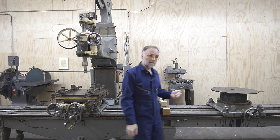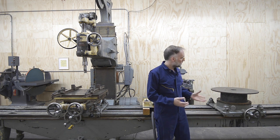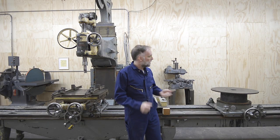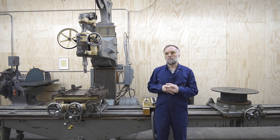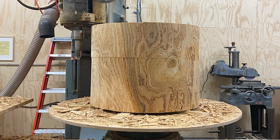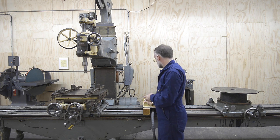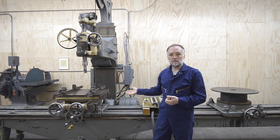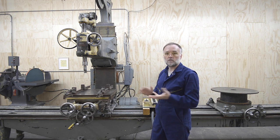The other table that came with this machine is an accessory table, which is just a rotate table. I find it very handy to have the two. One thing you can do is have your 10-foot-long piece on the machine. This table is also great for making round pieces. I make very large turnings, sometimes several hundred pounds and three feet or so in diameter, so I do the rough turning on this table and then take it over to the lathe already centered and rough turned. Both tables work with the bed lead screw powered travel, which runs at 2.5 feet per minute on low and 4.5 feet per minute on high.